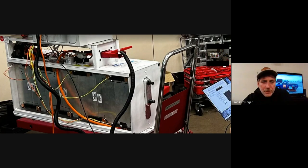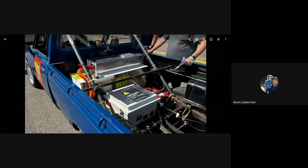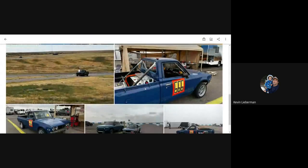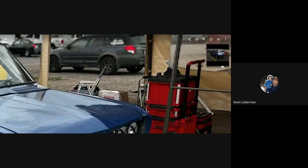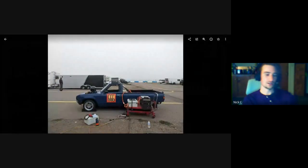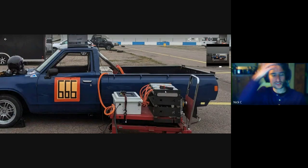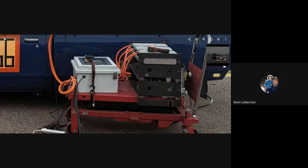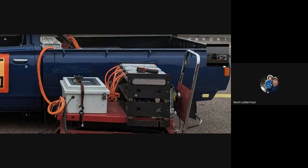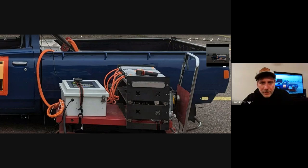Go ahead, Kevin. So you have a radiator. I'm thinking of this whole setup. You run it to a cart, to your RV stand, you plug it in, you plug in the radiator, you get everything flowing, you check for leaks and turn up the power. Yeah, so we'll have quick disconnect connections on the coolant lines, and then we have this Anderson connector, I think it's intended for forklifts, the main connector. It's got the two high voltage connections and then eight low voltage connections on it.